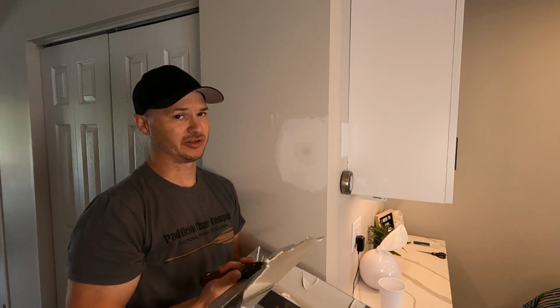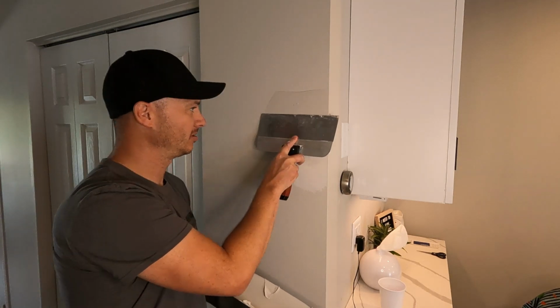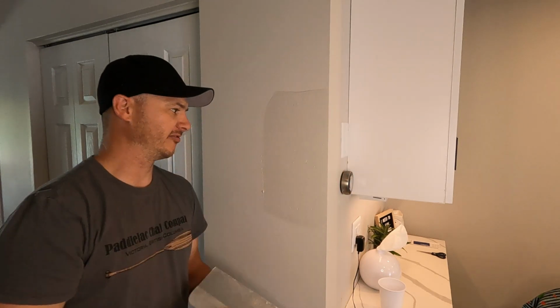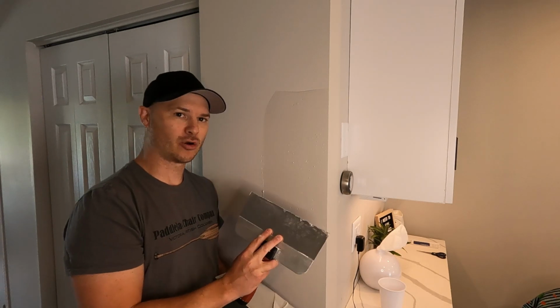It all depends on how we do it. We're not doing high production stuff, so you're just trying to get the mud on the wall at first. So I'm gonna go down a little bit, that's a good amount. Take off the extra. So now I got the mud on the wall, I wanna try and clean it up a bit and get an even coat.